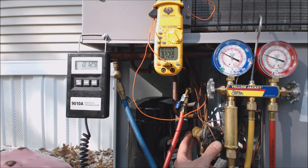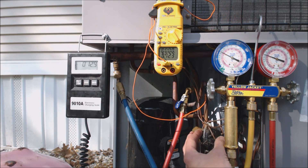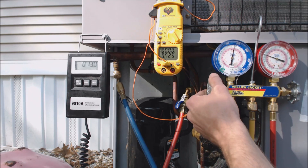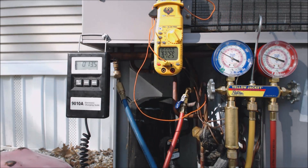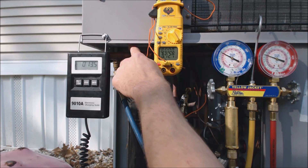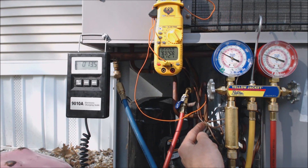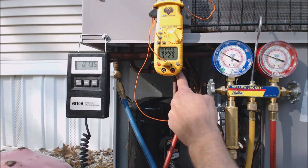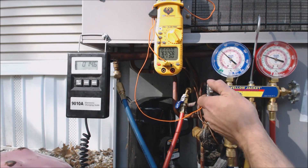This is our TXV — here's our distributor tubes down below. You have your TXV and the head is actually insulated. This is our suction line, and right up here they have the brazed-in external equalization tube for the TXV. Then you have the bulb tube that's mounted right behind the multimeter I'm using for temperature.